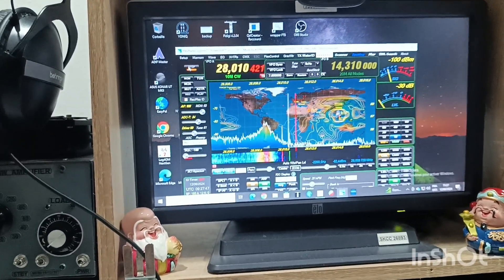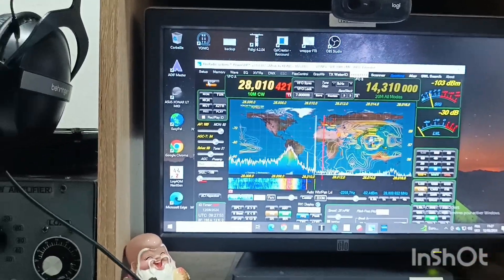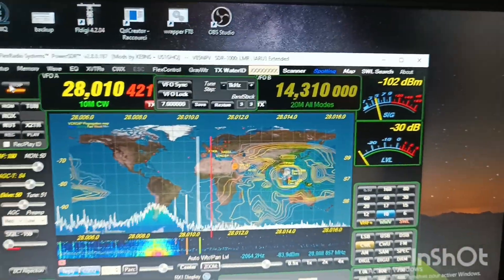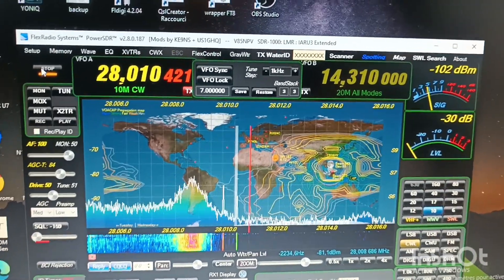Four wavelengths will be the perfect distance. I've set up everything — I'm on the 10-meter band. Currently I'm beaming so the back of the antenna is towards the generator. Here you can notice I'm almost at the noise floor: it's minus 102, minus 103.